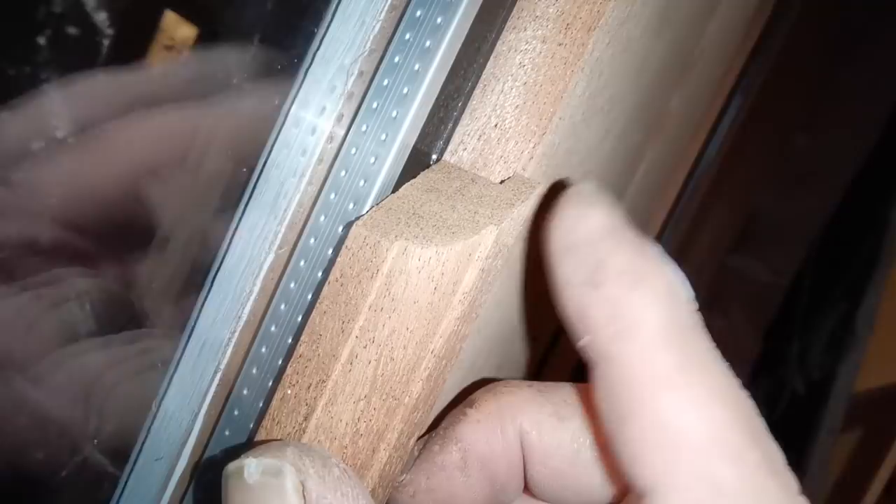It's getting dark but I don't want to come back tomorrow with all these beads wet, so I'm going to glaze it tonight. I've just dry-fitted that — it fits quite nice. There's only about two mil gap which is what I was working on, so I'm just going to seal it on the outside with silicone. I've got some low modulus stuff that the glazers have supplied — it's low modulus, something to do with the silicone solvent in it that doesn't break down the sealant around the edge of the unit.